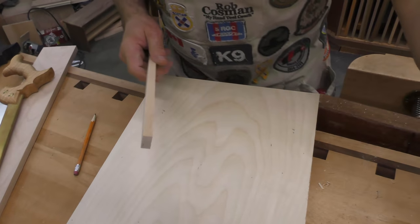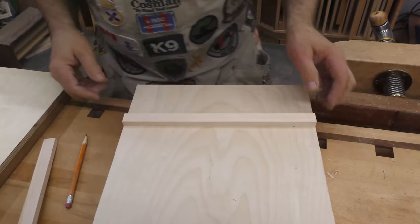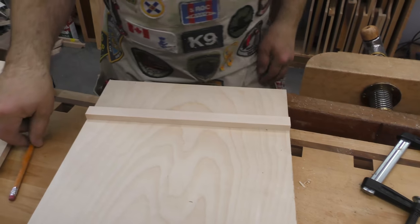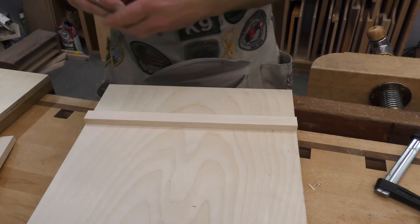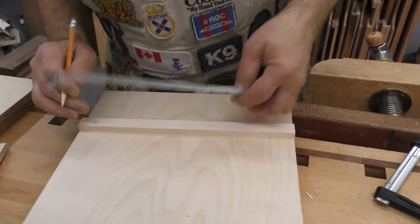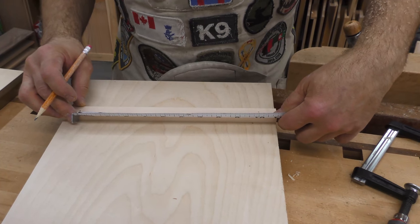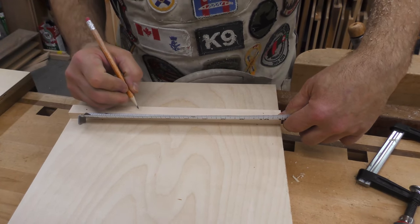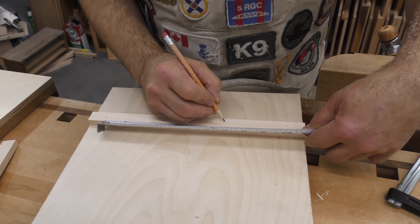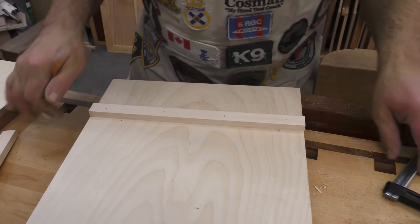Trim these at 12 inches, they're a little bit long. Okay. I'm not gonna glue these on, simply because you never know, you might need to take them off for some reason. So what we'll do is mark them first, probably 4 screws on there would be good. So we'll come in about 1 inch from the end. Inch, and then divide 10 by 3, so 3 1/3, so we go about 3 3/8, 6 3/4. That's good spacing.